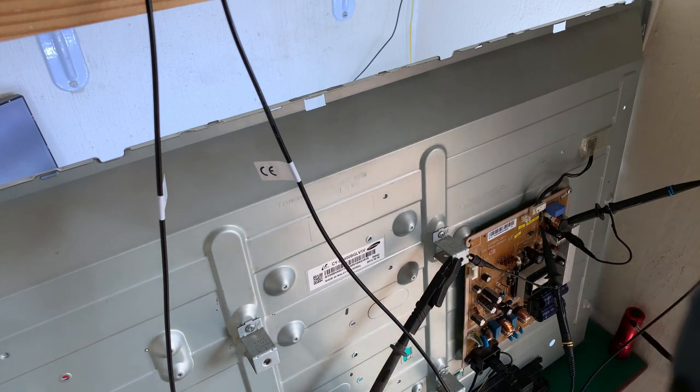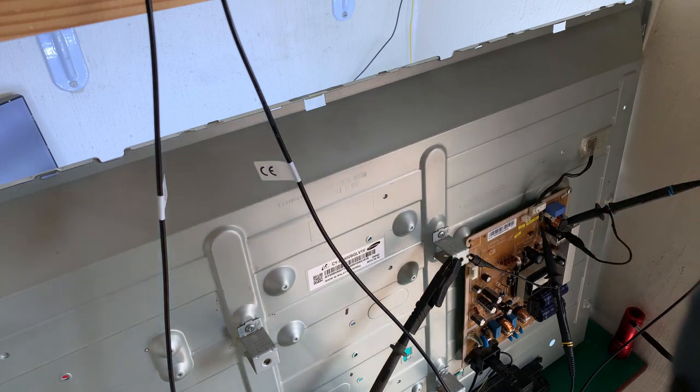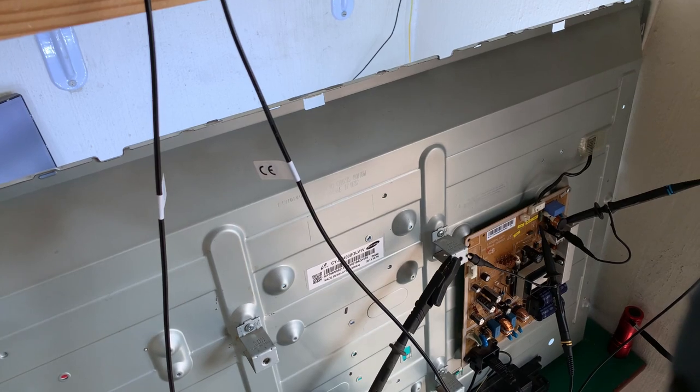So now what we're running is a free oscillator. Basically, the controller is running on its own at its maximum output. So it's fixed off time with maximum on time, so we're not giving it any pulse. So this is the maximum brightness without pulse width modulation dimming interference. So I'm going to change the resistor here, we'll set it up the same, come back and do the calcs together, and we'll see what we see.